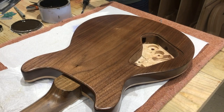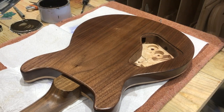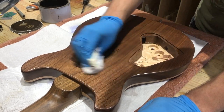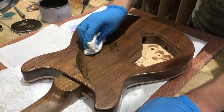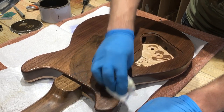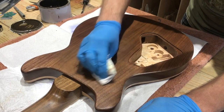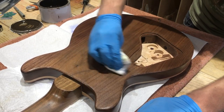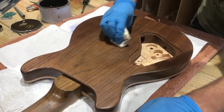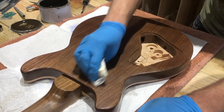So after three coats down, I'm really happy with how the booth performs — there are no massive plumes of overspray stopping me from seeing the work. I think the only excuse for orange peel I've got now really is lack of technique. One area where I wasn't particularly happy was the amount of open grain I could still see on the walnut. I don't think I got the best results using the aqua coat — I potentially oversanded it too much. It may have helped if I sealed prior to applying the aqua coat, or I may just not have applied enough, so I came back with my walnut grain filler and applied a coat of that.